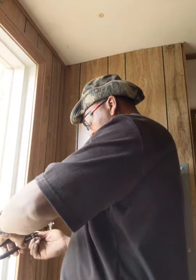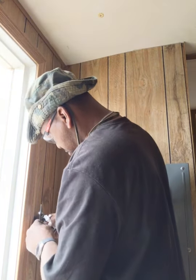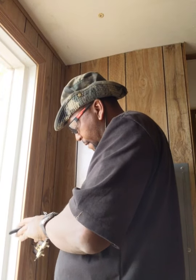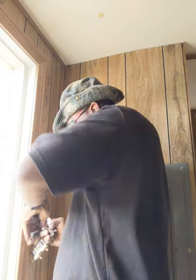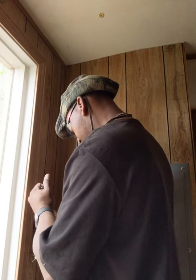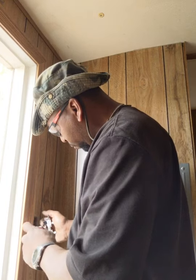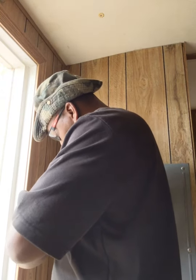Okay, again, I got a lot. Now this power wire, definitely don't want too much of it exposed, because if this hits anything, yeah, you're gonna have problems, because that's always hot. So I'll crimp it. And in this case, because I have so much excess of it, I'm going to cut it back a little bit. There. Now I don't have any fear of it hitting anything that it shouldn't hit and causing a short or a fire. Tighten that down.